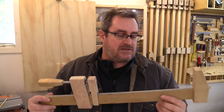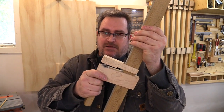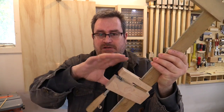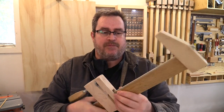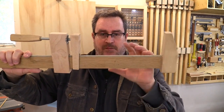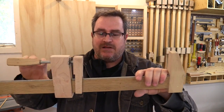Even though if you can build these ones, these would be the ones to have. The way this works and what makes it so good is that it locks into the thread like that, so you can adjust it really close. The lead screw part doesn't even have to be that long — it can be almost an inch shorter because when you can get it up close you don't need that much adjustment room. Also the bar, which I made out of oak for this one — though any hardwood would do — can be thinner, because the rod takes the tension while the bar carries the compression forces. The steel being a lot stronger than the oak, they kind of balance each other out so it doesn't bend.